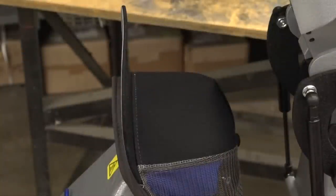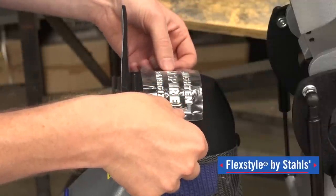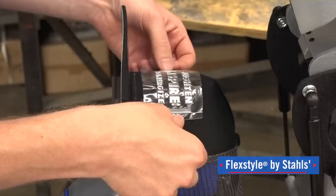Load the hat onto the press and flip out the sweatband — most hats have one, and if it's thick enough, you want to flip it out. Seat the hat down and lock down the hold-down device on the side of the press that helps hold the hat tightly against the heated lower base. You may have to wiggle the hat slightly to get good contact, because the last thing you want is a gap between the lower base and the print area — that can crease or damage the hat.